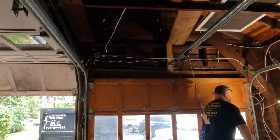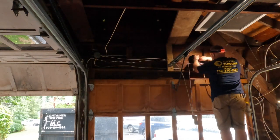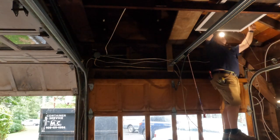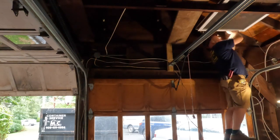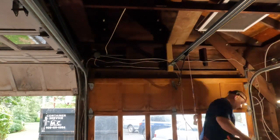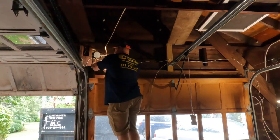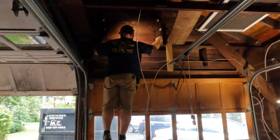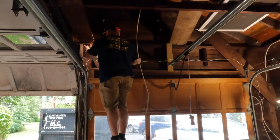I shut the garage door and I'm running a piece of 12-2 MC cable. You could use 14-2, but I keep 12-2 on my truck so I can run a 20-amp circuit if needed without carrying two rolls. MC cable is a light armored cable with an enclosed insulated equipment grounding conductor — so you have a black hot, a white neutral, and an insulated equipment grounding conductor. I use MC cable in an exposed garage like this to prevent any physical damage to the cable.